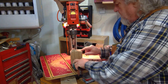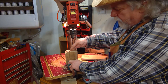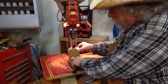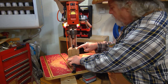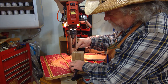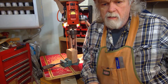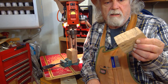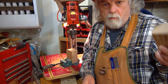I can probably get at least two more out of here — the hole can overlap into the hole area, you just don't want to hit the dowel. I can bring this one pretty close and get one dowel here, and probably at least one more over there, maybe even two. And my crack is not in my dowel. So now let's take this one and go over to the other area, and let me show you how I cut this down. Then we're going to go over a couple of fine details about how to drill your holes.